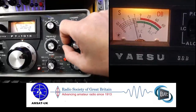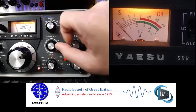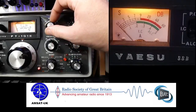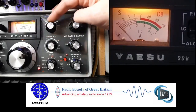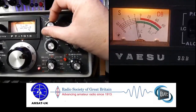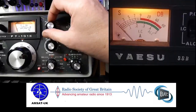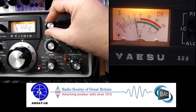Keep your transmission short, around the ten second mark. Now what you're going to do is turn the plate until the idle current dips. Turn it until it dips and comes back up again. There's that dip there.